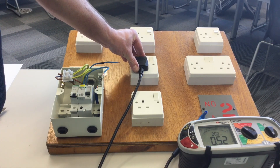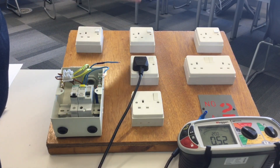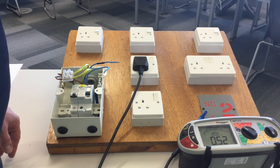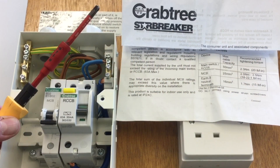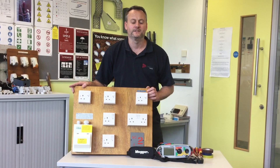We've completed all three stages of the ring final circuit test. We've proved it's wired as a ring final circuit, proved the polarity of the socket outlet at all three pin positions, and proved the switch opens and closes, so we can tick the polarity box as well. On completion I've returned the conductors into the consumer unit and tightened them using my torque screwdriver set to the manufacturer's torque rating in newton metres as specified by Crabtree. That's the ring final circuit test — all three stages completed.